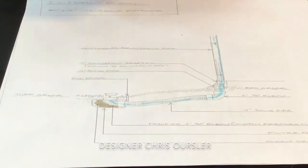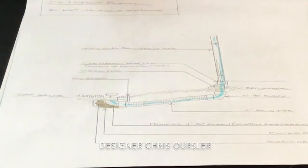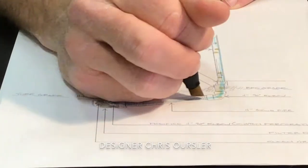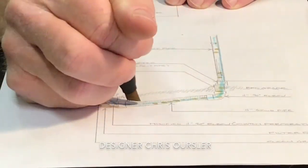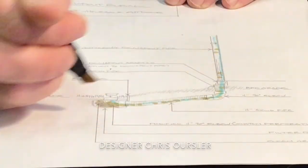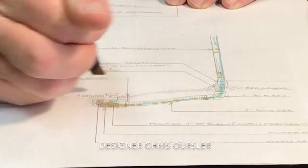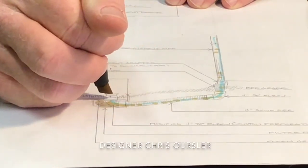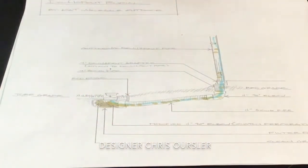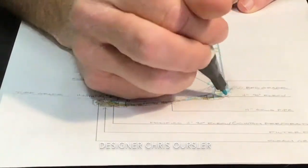We also forget about the fact that everything that comes into those gutters, like leaves, debris, all sorts of stuff, gathers up in this pipe and then rests down here. And if Bill and Nancy homeowner don't come out here periodically and pull this green cap off and scoop out and clean out their downspout connections, then they get backed up, and the water comes shooting back up and out the top of this and all over the foundation and creates a big old mess. So I'm sick of that.